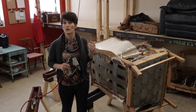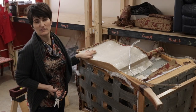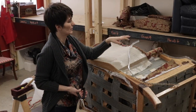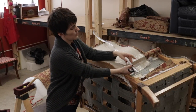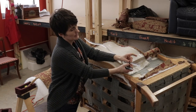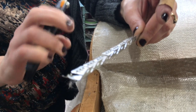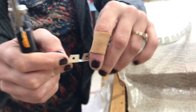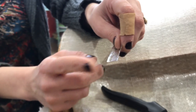My outside wing is already prepped, meaning I have burlap on here to create support for my padding, so I get to jump right in at the step of attaching our ply grip. Let me show you how this works: one half has teeth on it and the other half has a hole to staple through. Down here I'm going to end up hammering this edge closed, so I'm not excited about having a cut sharp edge. I'm going to cut through a hole and take that piece off so when I come back to hammer I'm not hammering against a cut edge that might cut through my fabric.